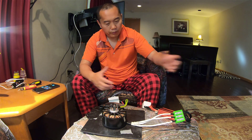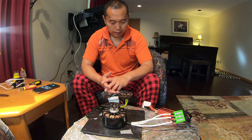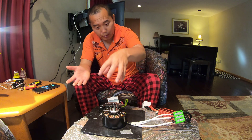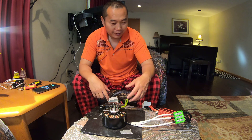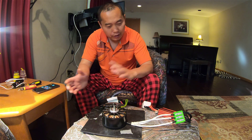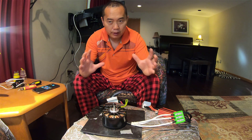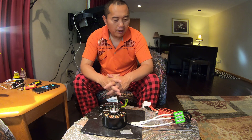Pull your frame together, and finally put on your propeller — remember the propeller is the most dangerous thing. Even without the propeller it's safe, but with the propeller on it's like a cutting machine that cuts everything. That's why you want to put everything together on your frame first, and then finally mount the propeller, place your frame somewhere safe, and then test the propeller thrust.